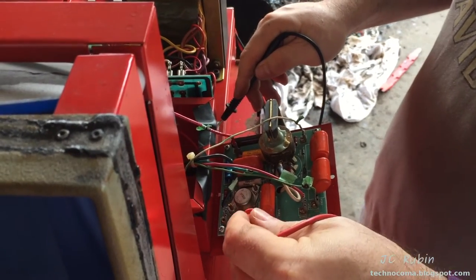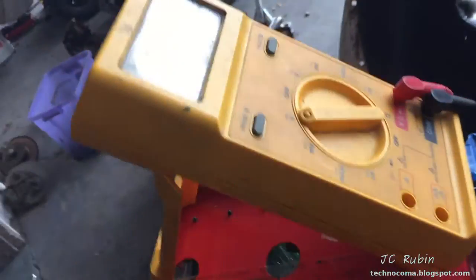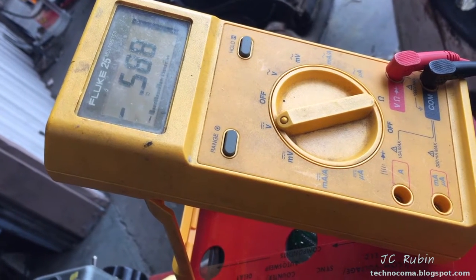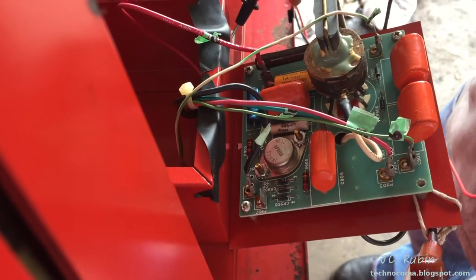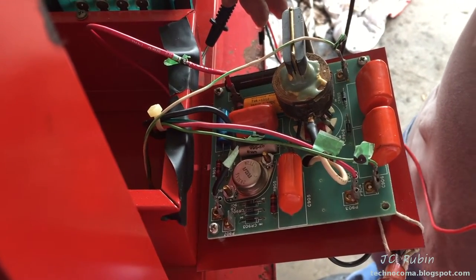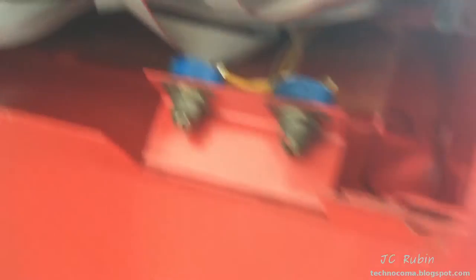I've read voltage drops across here. One important note — reading the voltage at the diode that goes to the 2N3055 transistor — I don't know if this is perhaps a bias, but I'm seeing negative 2.28 volts DC. It's hard to hold it on there sitting this close to the power supply, but negative 2.28. So if that is the bias circuit for this, then I guess we're getting something. I'm curious to know, if those circuits — the focus and intensity — are operating correctly, what would happen if the other sides of those pots got disconnected somehow. So I'm going to read some voltages through those, since these wires clearly go there, to make sure they're getting to where they need to go.